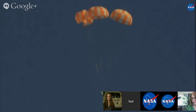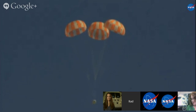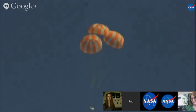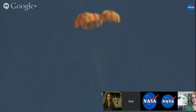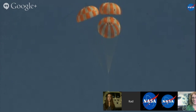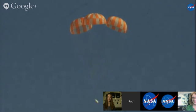We designed this assuming that the parachutes share the reefing. Reefing is a way to open the parachute gently or softly. If you went full open, think of going extremely fast and hitting your brakes really, really hard — you put a lot of energy into things. It dumps a lot of energy both into the structure of the vehicle and into the parachute. So we have ropes that constrain the diameter of the parachute, and they have pyrotechnic timers that allow them to open up 10% initially, then 20%, and then full open. That allows you to open up the chutes gracefully and more slowly spread the energy into the parachutes and the vehicle. By reefing, you control and manage that energy, and it allows you to not design and carry quite as much mass in the system.